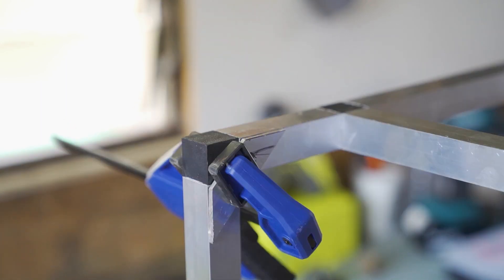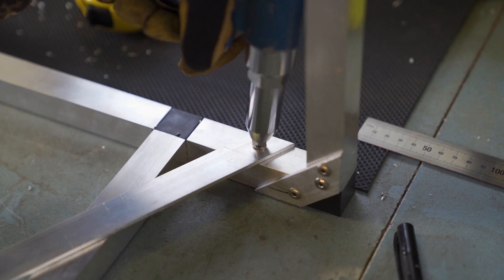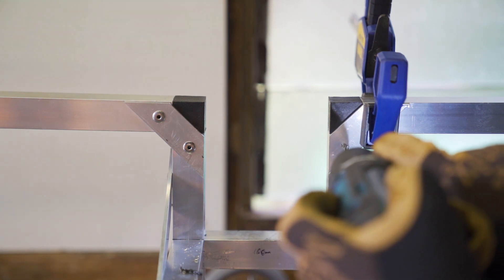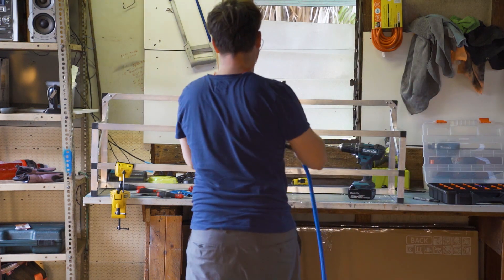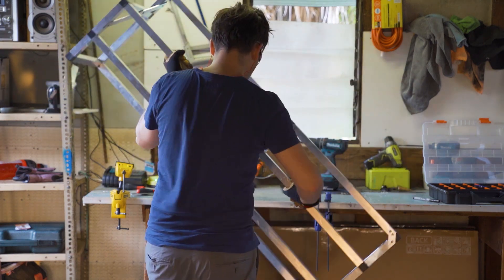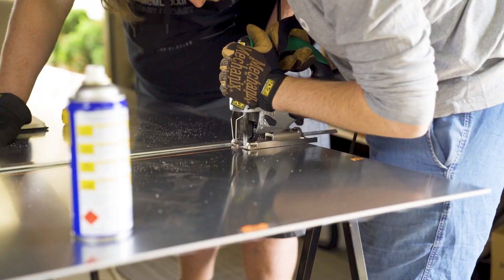Without knowing the lifespan of the corners, I figured it would be smart to reinforce with some simple gussets. I did this for all of the outer corners, as well as installing a vertical gusset for the cantilevered extension. It was at this point I wondered if it would have been easier by riveting the whole thing and not using the plastic pieces — maybe ask me in two years. The square cuts and clean finish made the process really easy, but with that said I wish I had done this aluminium top deck differently.